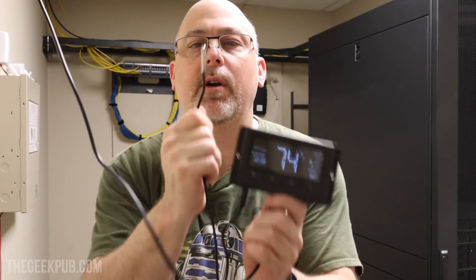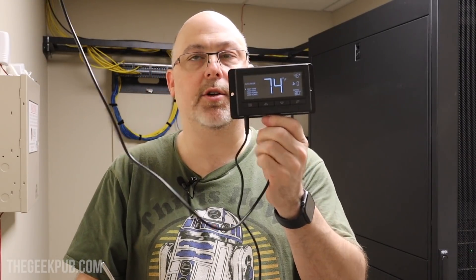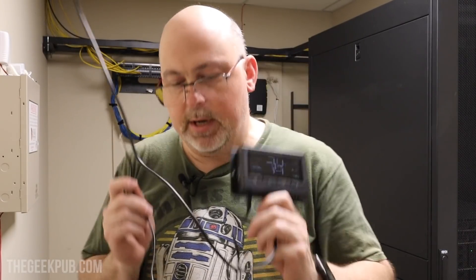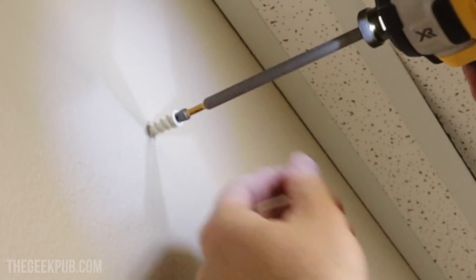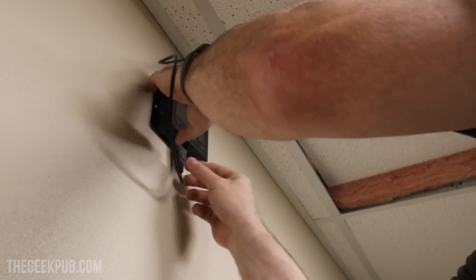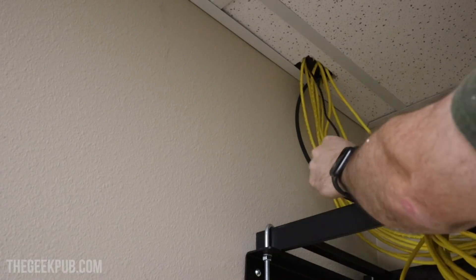The AC Infinity has a control panel that monitors temperature and humidity and will turn the unit on or off, spinning the fan up or slowing it down. It also has a temperature probe — wherever you place it is where temperature is monitored. I'm going to hang the control panel on the wall near the ceiling and put the temperature sensor on the ladder rack, closer to the exhaust of the server rack. I hung the controller using a couple of screws and drywall anchors and ran the cables down from the drop ceiling. I really wish these controllers had the option to run cables inside the wall and plug in from the back side. I ran the sensor cable through the ceiling and over to the ladder rack, secured with some velcro.